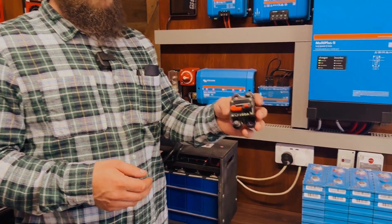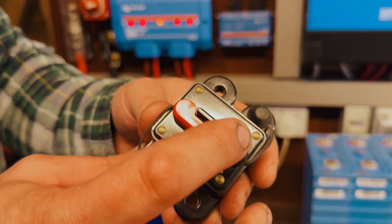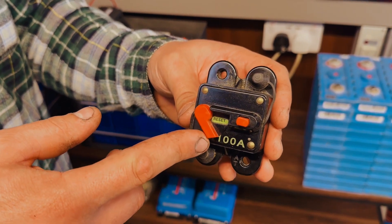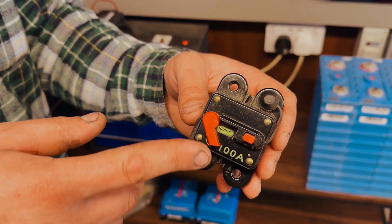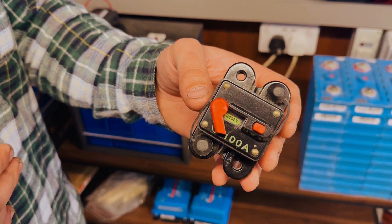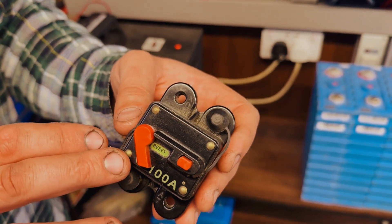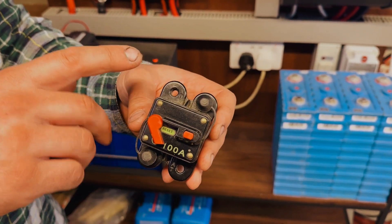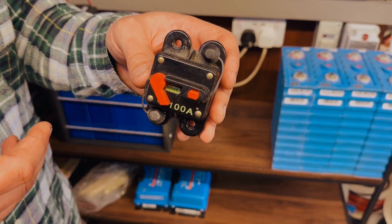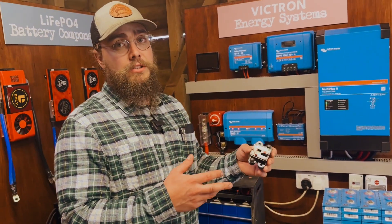This one here is another good example — these are very common and popular, and a lot of people use these sort of switches. It's a circuit breaker type single pole switch, but it also allows you to break the circuit if you want to turn things off. A lot of people will use these for their systems, for their solar, et cetera. We were tracing back an issue where there was significant voltage loss on a particular circuit, and what we found is that this clearly has an issue — there's potentially not a good contact within this item — because from one side to the other, the voltage drop was significant. I'm talking two volts or more, which straight away is extremely concerning when you have something that's supposed to add protection but isn't even carrying the current through correctly without voltage drop.